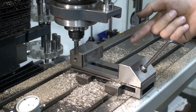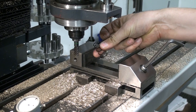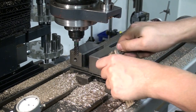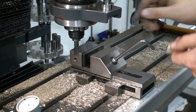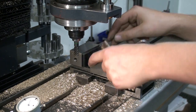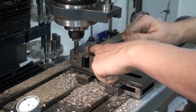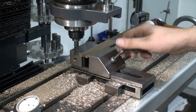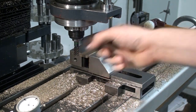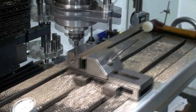And as this is a multiple setup, I have my two parallels and I will drop in a spring between the parallels so parallels don't fall out or get sucked into the cutter, which would suck because this is a quite expensive new six fluter. I would normally use this only on steel and finishing cuts, but in this case it's the only bigger brand new end mill that I had.